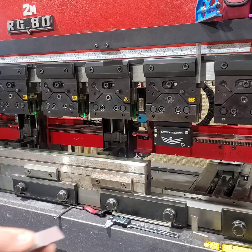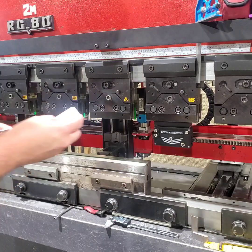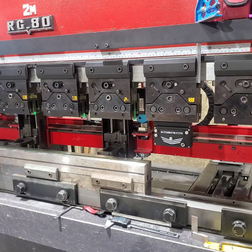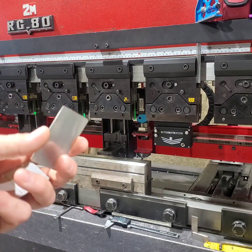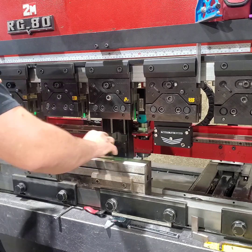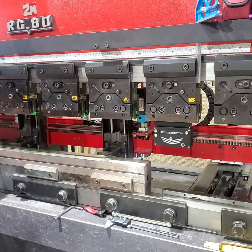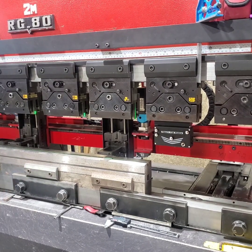The light kind of dissipates off that reflective surface, so if you have a light right above your back gauge or right above your beam, you might want to turn that off so you can see this a little better on such reflective material. These plates are 60 millimeters and the scribe line is 30 millimeters from the edge, so you can set your back gauge to 30 millimeters - that's 1.181 inches. For European lowers or larger lowers that are 60 millimeters, throw them on a couple feet apart, take a flat edge and butt it up against there to make sure it's squared up.